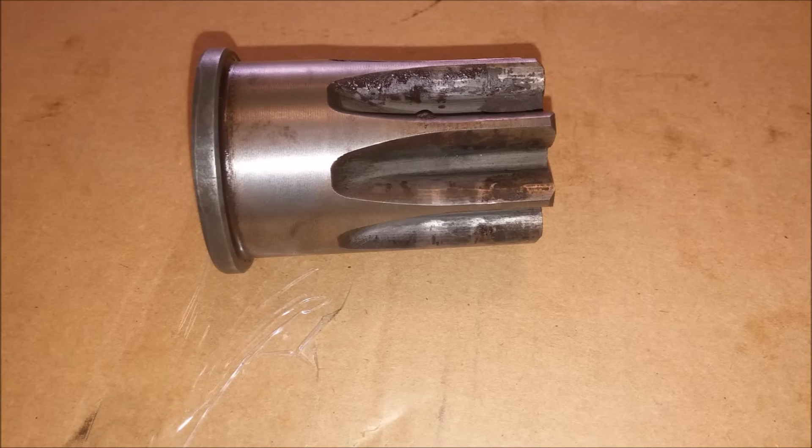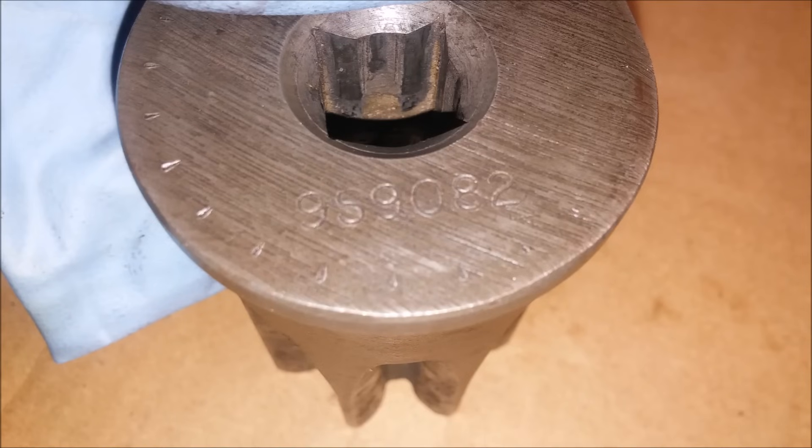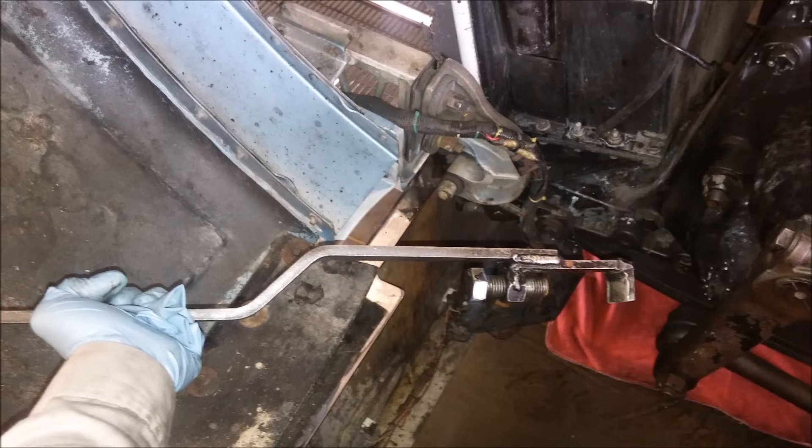Here's the turning tool from Cat for turning the flywheel. It's about $129 from your dealer, about $86 as a Cat employee — look for a used one on eBay. You can also turn the engine at the front using some sort of tool — you can make one, use a pipe wrench, or similar — and turn the front dampener using the marks you've already made.